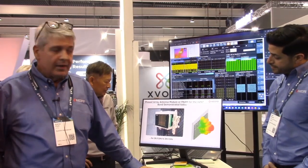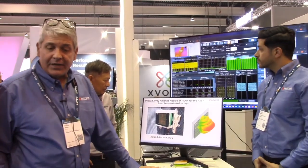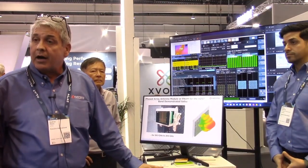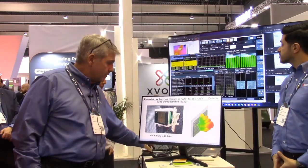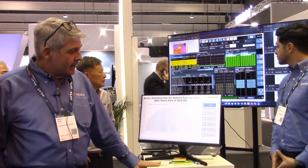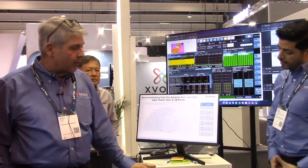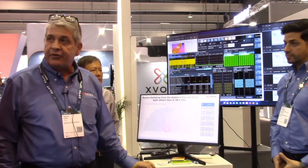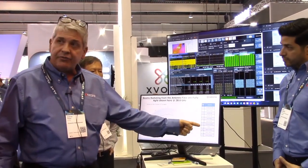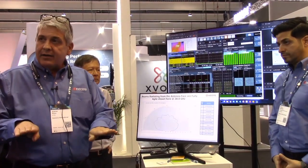This is a close-up of the antenna and an animation of the dynamic beam shaping capability that we programmed into this antenna, as required by one of our base station customers. To be specific, they have asked us for seven types of beams, from very wide — 110-degree beam width — to very narrow, at 15-degree beam width. And then also the intrinsic beam, which is uniform illumination, as well as taking that intrinsic beam and lowering the side lobe from 13 to 17 to 20 to 25 dB.